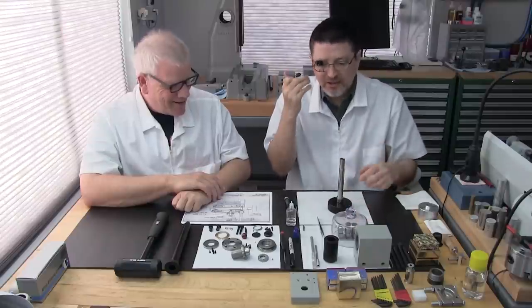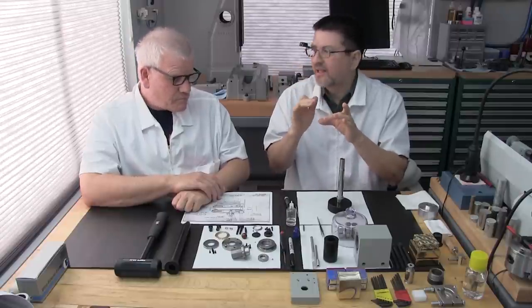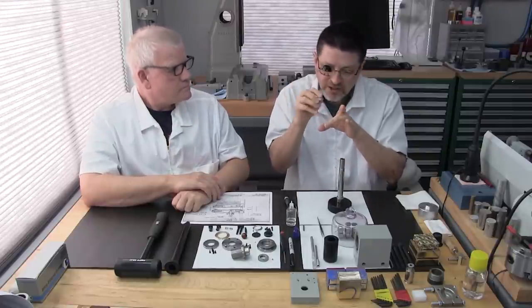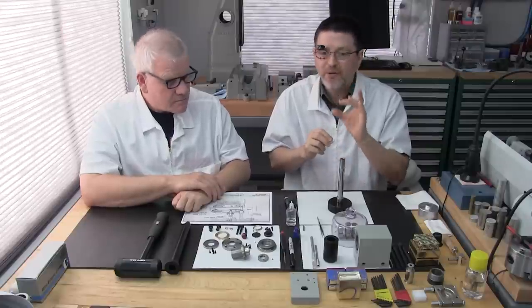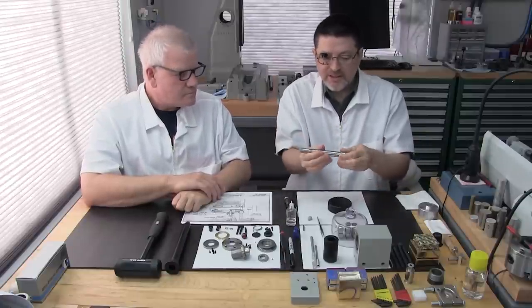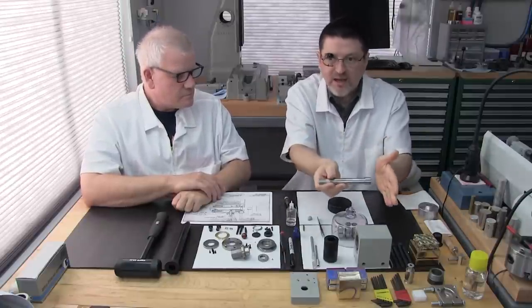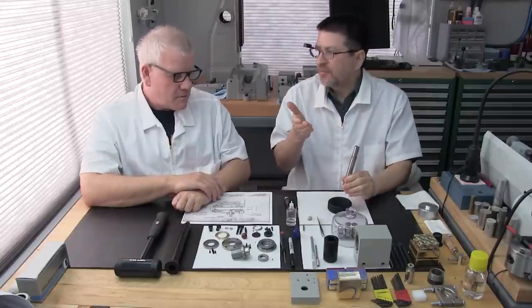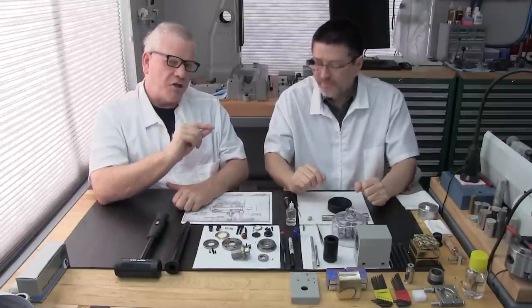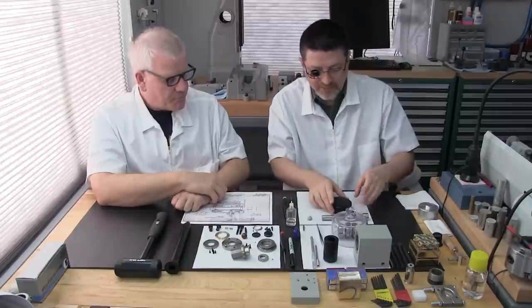What you're going to need this with the loupe for is, when we install a bearing, before we install it, we want to take a really good look at it to be sure there are no particles, dust, lint, hair, eyelash, anything. If we do detect anything, you'll use your tweezers or the Rodico to just dab it off. Very important, because once this assembly is built with the bearings and we install it into the headstock, you're never going to see the bearings again until you do another rebuild. So it's worth every second of time to do these little details. Minute as they sound, they're all about longevity and wear.